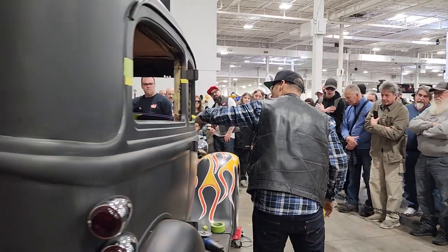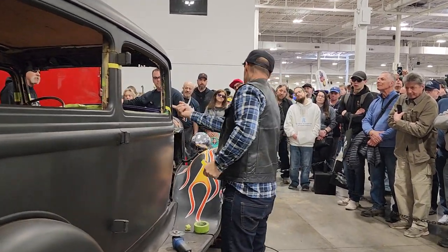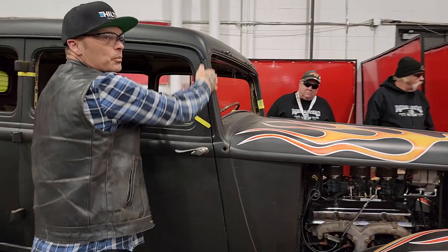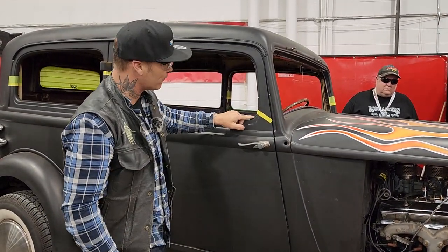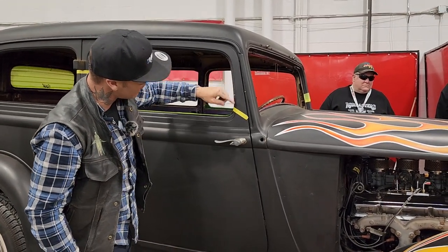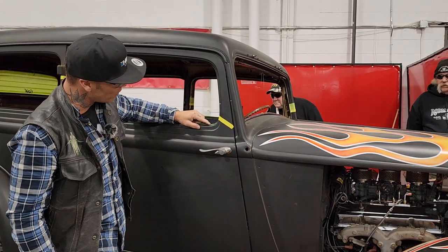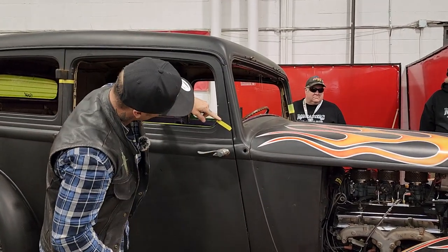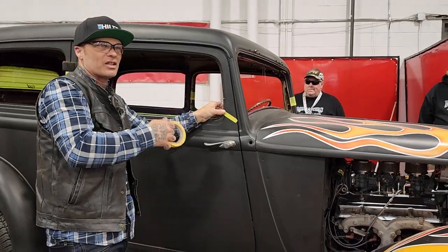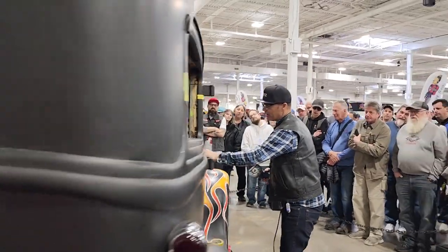You're probably going to ask why I'm cutting it on an angle. This is what I'm thinking in my brain. When I cut this post off, I didn't want to cut the post off up here and then try to lean the post back. I want to cut the post in here down where the windshield post is, so when I bring that back, it's completely straight. If I angle it, I don't want to get into this corner or move anything. I'm angling it like this because when I put this piece back in, it's going to go right down to the bottom of that post so I can angle it back with this perfectly. If I cut it down here in this round part, then I have to try to make something there. But if I get down to that part there, I can make this line straight with this line, because this whole post is being moved. So that's why I'm making an angle. I hope I explained that right, or that's what's going through my brain. I don't know if that's a good thing or a bad thing, but I'm going to cut it off, Kenny.